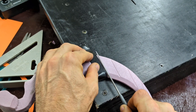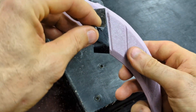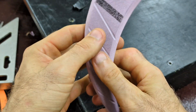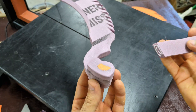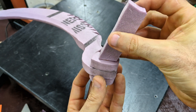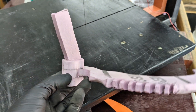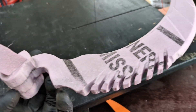Afterwards I realized it looked pretty plain, so I decided to make some straight lines using a round file. I used some electrical tape to make a uniform fit for both sides. Now I have to glue on a sprue — this is going to be where the molten metal flows into the pattern. It's now the following day, the glue is dry, and it's time to do what they call the lost foam casting process.